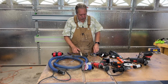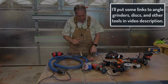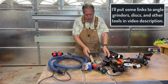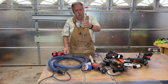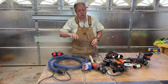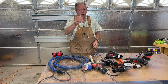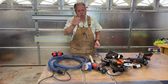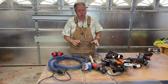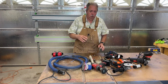In addition to the wire brushes, we just talked about these power wire brushes and so forth. We shouldn't forget there's always manual wire brushes to get into crevices and cracks. Another tool you'll find me using at times is a screwdriver if I'm trying to get into an area where I can't get in with the brushes and pick it out. Or if it's a real small area, I'll even use dental picks. Anything that I can get in, awls, anything I can get into the cracks and crevices, because remember, all bark has to be removed. Anywhere where you're going to have epoxy poured over it or touching it.